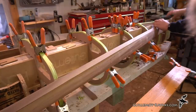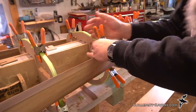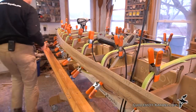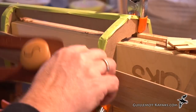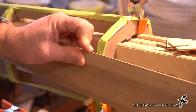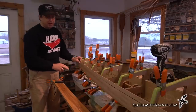We might want a little bit of a twist here. Hold it in place briefly with the clamp. Need a little bit more bevel there — I can close it up by tilting it. Make sure it's not just something on it. That's better; it's fitting right up tight against the form. Can't close it up by twisting it, so we're good. With the strip all fit and the bevel good, it's time to put some glue on it.